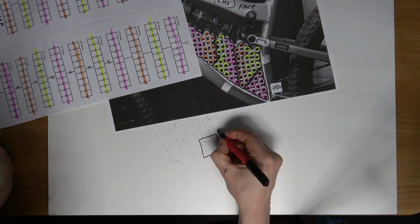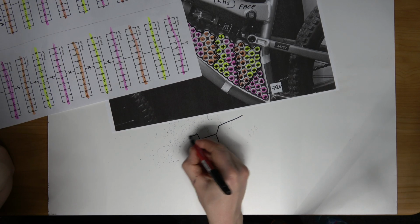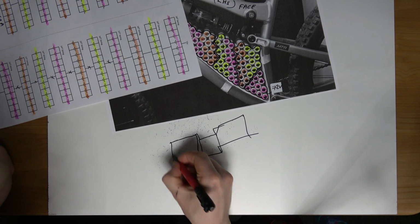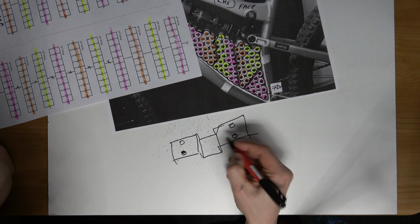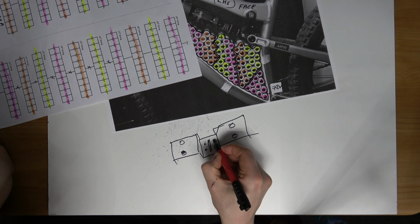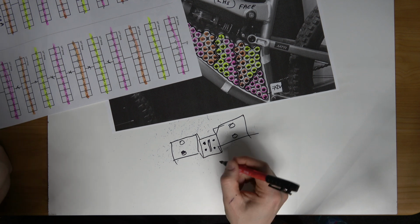And what we'll have is a wee insert like this. See if I can draw this. Like that. Well, you're not going to see that. Like this. And these will be welded to the copper plate. And here will be a wee line to let the weld current through, so these are properly welded to the cells. So this line's actually important for the welding process.